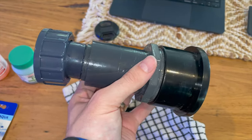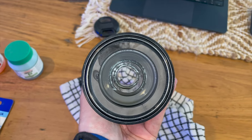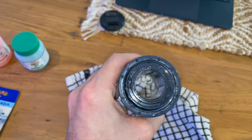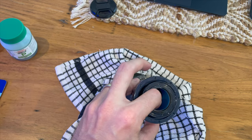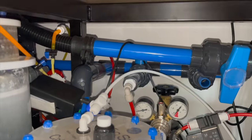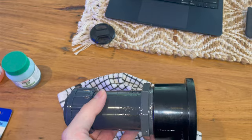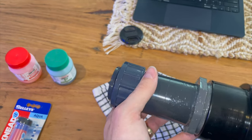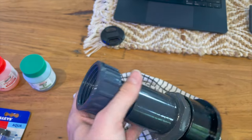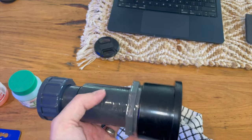Now, even though it's a monstrosity with seven fittings in it, as you can see, there is no reduction in the size of the pipe or restriction in the flow beyond the smallest part, and the smallest part is the blue 32 mil pipe, which is consistent with all the rest of my plumbing. So that's important when you are considering building a monstrosity like this. Make sure you don't have any restriction in the flow that reduces the size of the water path below your standard piping. So you always use bigger fittings with reducers in them to make these couplings between different standards and things like that.